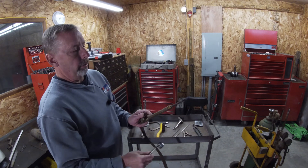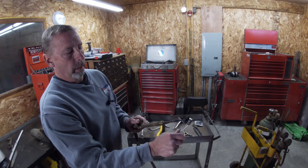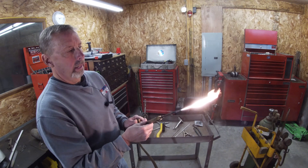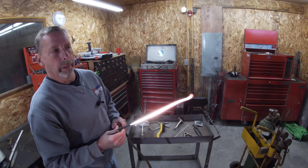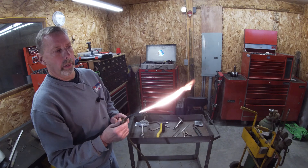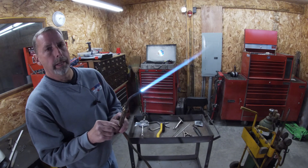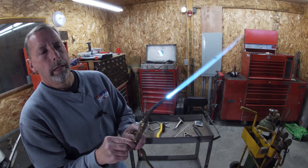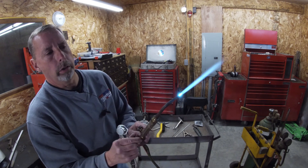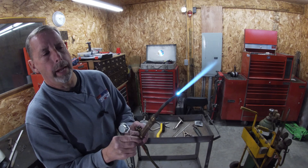When using your torch, this is a number zero tip — usually a zero or number two, fairly small. We'll turn on our acetylene, and you can see that's a lot of carbon — the black soot coming off is carbon. We'll eliminate most of it, but we want just a little bit of carbon coming off for brass. Then we open up the oxygen, and you can see there are actually two flame tips — a real close bright blue one near the tip and one farther out — and we're going to pull those back together.